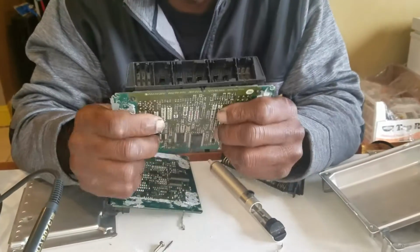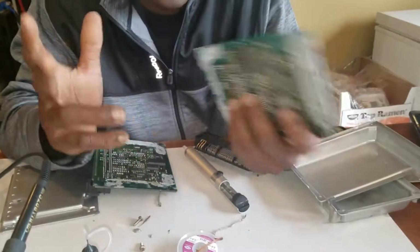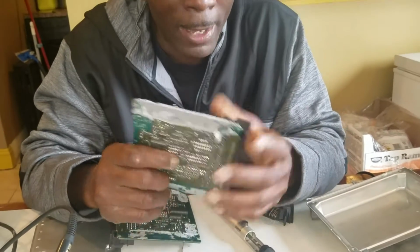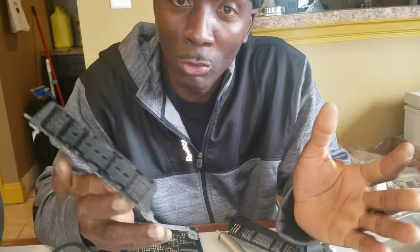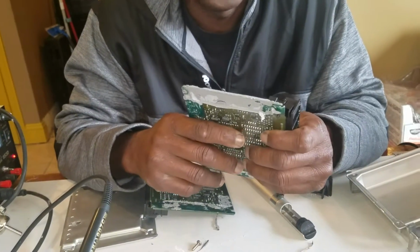coming up into the coding after I finish coding. But what was happening, the car would not start. I tried syncing the DME, EWS synchronization. I did all of that. Still would not fire. It wouldn't turn over. You know, I have a donor 2001 740IL, which I could have just swapped the DME, EWS, and the key, everything into my 740i, but I just didn't want to do that.